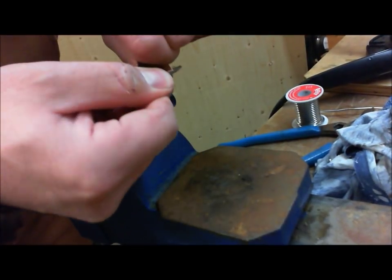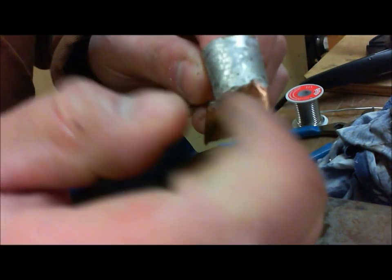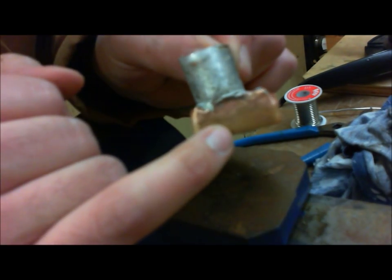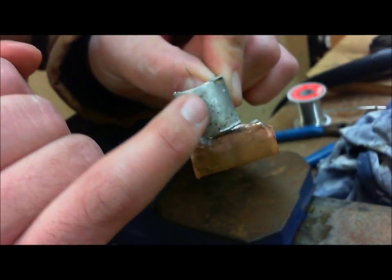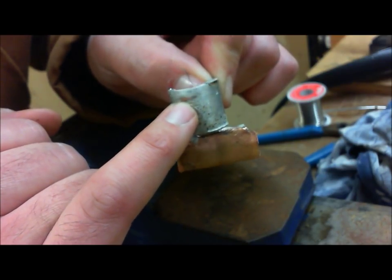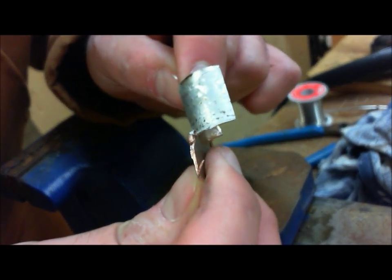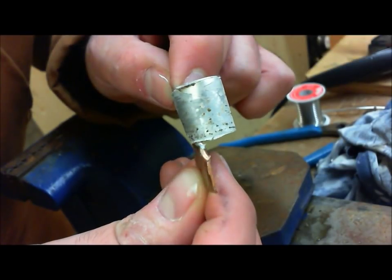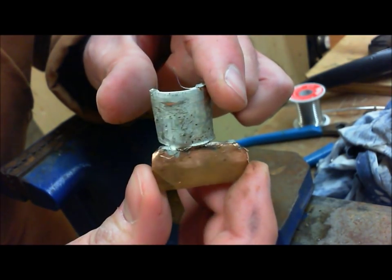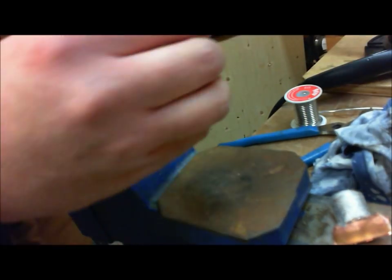All right. Here is your copper. All right. Here's the copper. Look at this. If you don't see any copper in this section, other than where the tip of my baby finger is, then you begin to notice that we got a pretty good joint. All right. Look. See that? Pretty good joint all the way around. And the reason for that is because we don't overheat the joint, so we don't burn the flux out, but we also have good coverage.